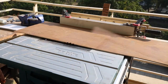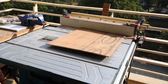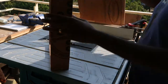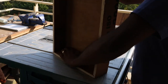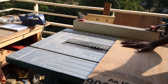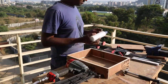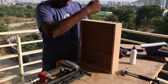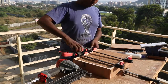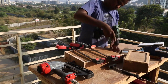To create the bottom of these drawers I cut some 6mm plywood to size. These plywoods will go into the slots that I cut earlier with the router. The back side being shorter allows easy access to insert these bottom plywoods. To secure the bottom I apply some glue before inserting the sheets. The side plywoods are a little bent so I use clamps to hold until the glue dries. I pre-drill some holes, countersink them, and then secure it with screws to the back side alone.